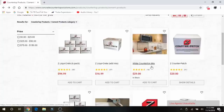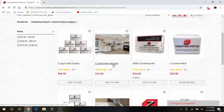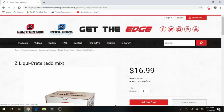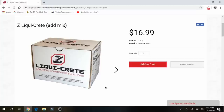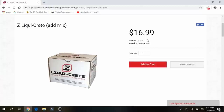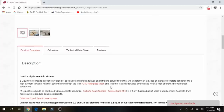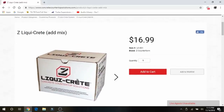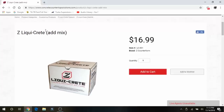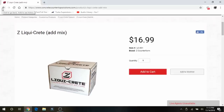If you're not wanting to do white concrete, they also have their LiquiCrete systems, which are additives with chemical bonders and fiberglass in it. You can mix these LiquiCrete bags one-to-one with a standard 60-pound bag of QuickCrete, making it a little cheaper. It's $17 for the LiquiCrete and your 60-pound bag of QuickCrete is about five or six bucks, so you're looking at about $25 a bag. I would definitely recommend their additives because they'll increase the PSI of your concrete and eliminate cracking.